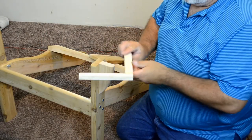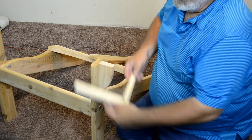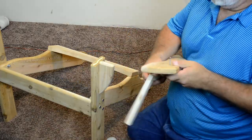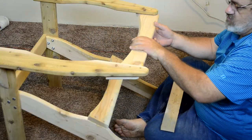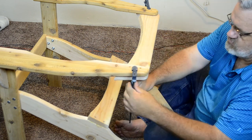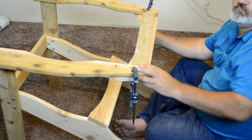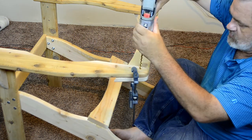This is just a little jig I made to help me line up the armrest. Now moving on to the back, I'm putting the upper cross piece in, and I also have another little jig — I believe it's 11 and a half inches long; you have to pay attention to the plans. This brace helps me space out the back part of the arms perfectly. Now I'm going to bolt both of these down — don't forget each of these joints will need glue also.